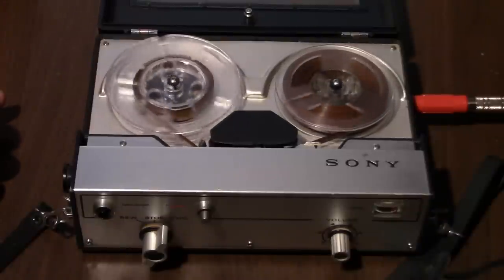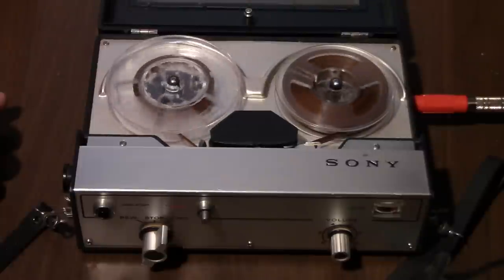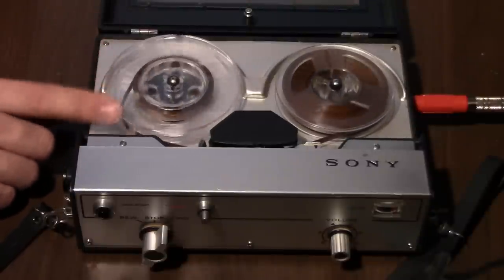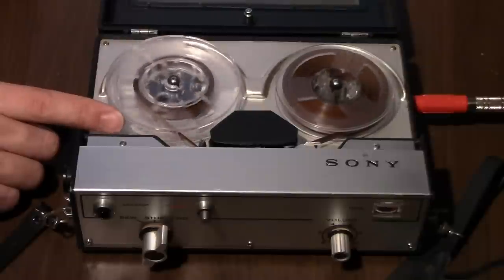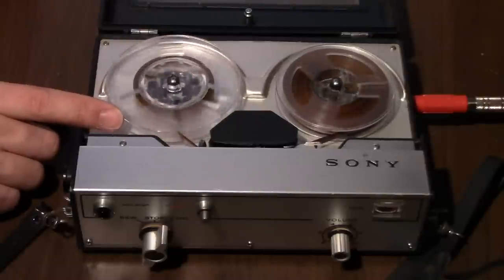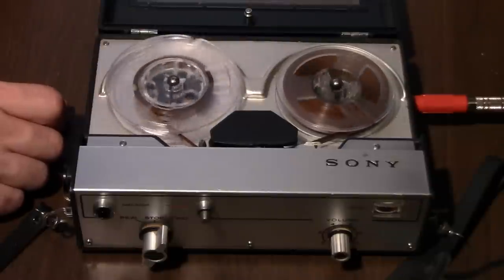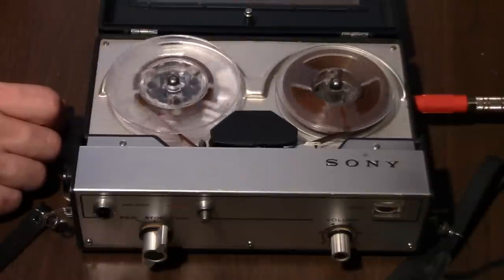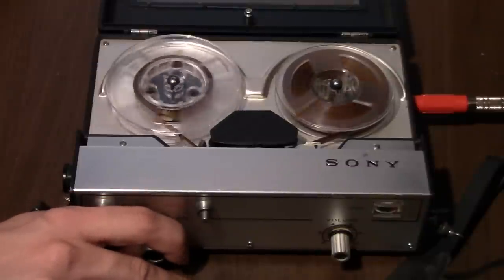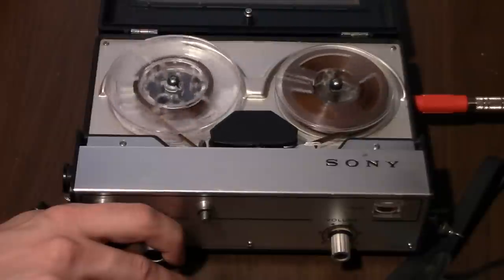connections so that I could get easy access to the other side, and use the old Hakko desoldering station, which really came in handy because I replaced every single electrolytic capacitor on the amplifier board, because when I probed them with the ESR meter, aside from a few capacitors that were only slightly leaky, the grand majority of them were so thoroughly leaky that the meter on the ESR meter itself didn't even budge one single bit.